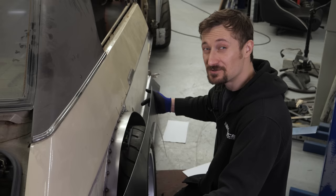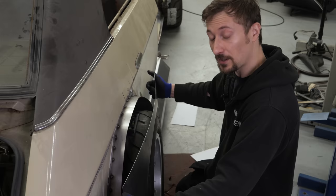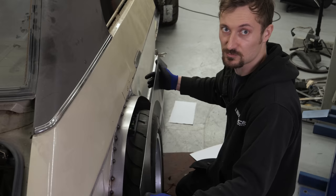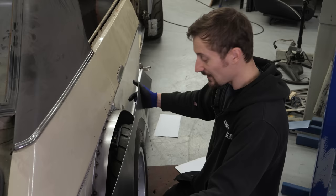It's going to want a little bit of Astra GTE Mark 1 wheel arch, or maybe a bit of Mark 1 Nova type arch at the back, like a Nova GTE. Like a slightly boxed wheel arch, but with a bit of curve in it. So I'm going to put a slight bit of roll in this. I could do it with my hands, but I just want it so I don't need to hold it. Slight bit of curve in this, and then I'm going to cut a piece to attach it onto the body. So yeah, let's put a bit of roll in it. Just needs a tiny bit, and then attach it to the car body.